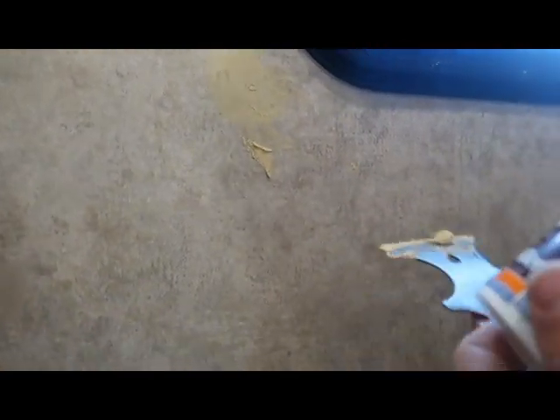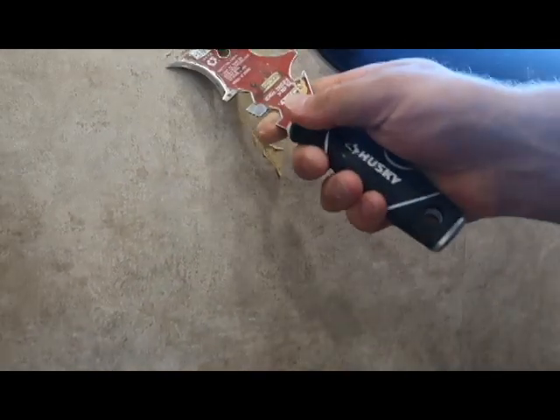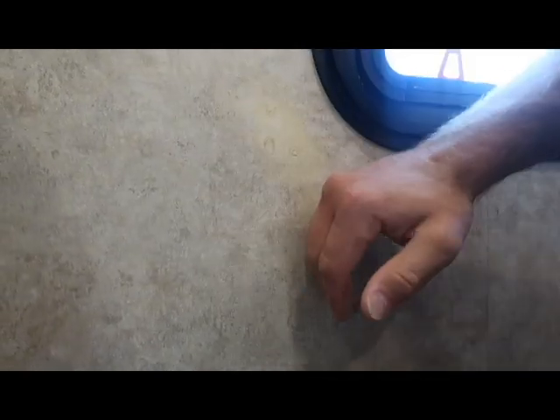One reason you want to do this is to have a smooth finish. One reason you want to do this is so when you're painting, you have a nice smooth finish. Two, if you have a hole in the wall and you're painting over it, the hole will fill up with paint and then leak out while it's trying to dry. Whereas if it's nice and smooth, you won't have that issue. Once you have this on there, you let it dry — I think this one says 15 to 20 minutes — and then just real quick, take your sander and hit it, really smooth and quick. It doesn't take much to sand it back flat again, and then you're good to go.